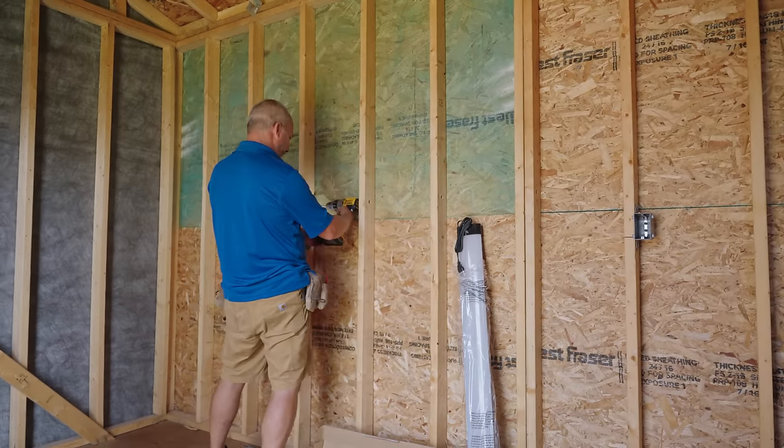The point is when the inspector sees this plug and he sees white wire, you're done, you fail, because you don't have the right power. So make sure you get the right combination. If you're thinking of upgrading this so that these could run on 20 amps, or you can run your power tools in here later, then run the 20 amp wire, which is a 12 gauge, not a 14. So 14 is 15 amp. With 12 gauge, the smaller the number, the thicker the wire, and it carries more power. That's the 20, all right? And it'll say right on the wire. These things are all printed up, so if you're not sure, you can always check. All right, I just wanted to throw that at you real quick.